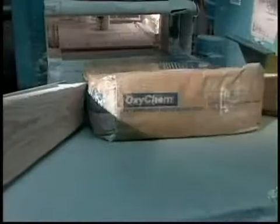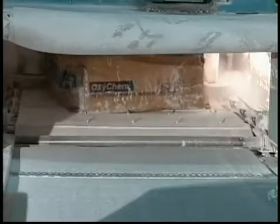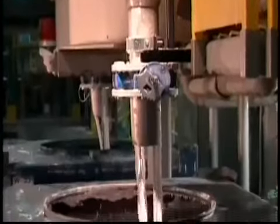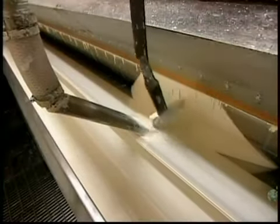areas. To make that vinyl foam, they first mix the powdered ingredients: polyvinyl chloride resins, or PVC, white pigment, and calcium carbonate, which acts as a filler but also helps color the mixture white. In a separate mixer, the liquid ingredients: plasticizer to make the vinyl flexible, fungicide to prevent mold growth, UV stabilizers to prevent fading, and a blowing agent which they later activate to inflate the foam. They combine the liquid and powders and mix for another 15 minutes.